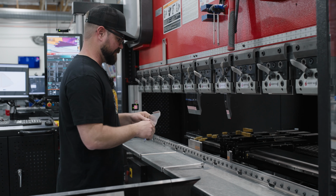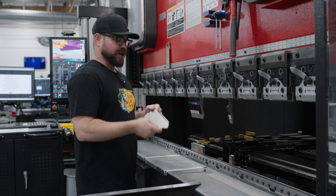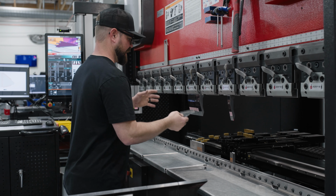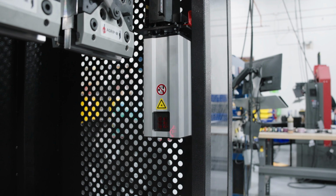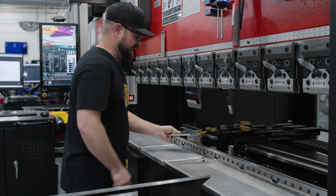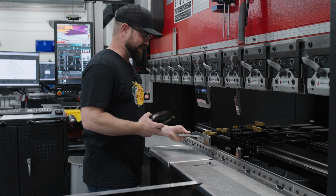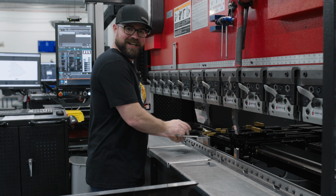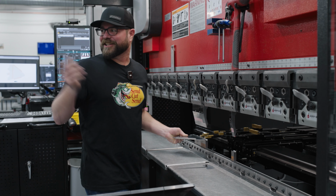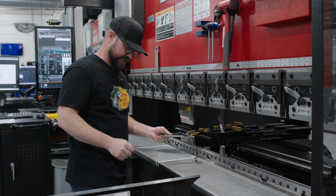One of the questions that people often ask when I post little videos on Instagram or X of me running the machine is, oh my God, I can't believe that you get your fingers so close to that machine. What's really cool is the machine has a bunch of awesome safety features. One of them is this laser fence. The laser fence is looking across all the tooling, and it's looking for this material thickness. As soon as something comes into contact, such as this, the machine is going to alarm out. So I'll do my operation, but it won't cut it. That made me really nervous, even though it's not mine. Thank you for letting me lend that. So if you slip or whatever, the machine does give you a chance to save your fingers.